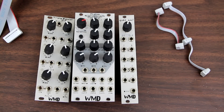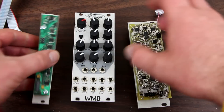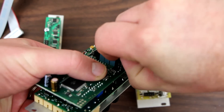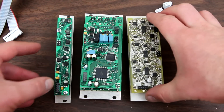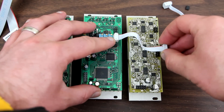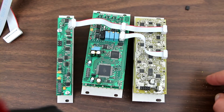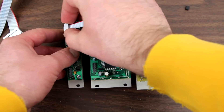To assemble your Triple Bipolar VCA to the Phase Displacement Oscillator and Quad Anti-Aliasing Filter, if you have one, first flip them around in opposite order — you will see three jumper sockets here that need to be removed. Using the short six-pin to six-pin cable, red stripe up, attach to the lower pin header on the PDO and the lower pin header on the Triple Bipolar VCA. Using the triple cable, attach to the upper pin header, red stripe up. If you don't have a quad anti-aliasing filter, fold this back and out of the way. If you do, plug red stripe up to the QAAF.